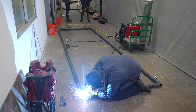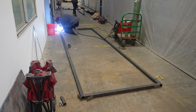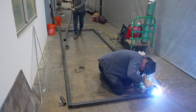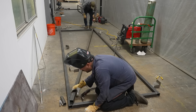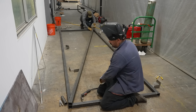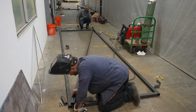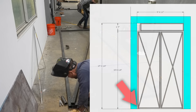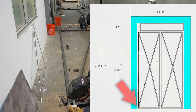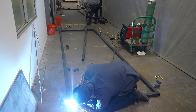With that on the ground, Matt can start tacking stuff up. While Matt's working on that, I'm in the background doing some more field verification and fabricating the other hinge and drilling holes while he does the welding. When it comes to putting the cross bracing, I want a continuous bar on the hinge side going down to the bottom, and these are going to have sort of an X pattern in them. We just lay out the tube, mark it with a Sharpie, and while Matt's welding I'm cutting them up with the circular saw.